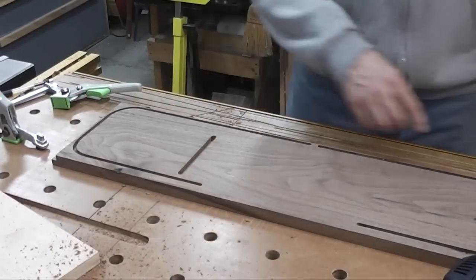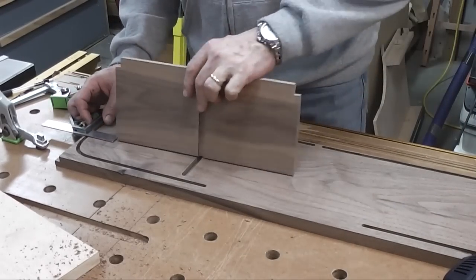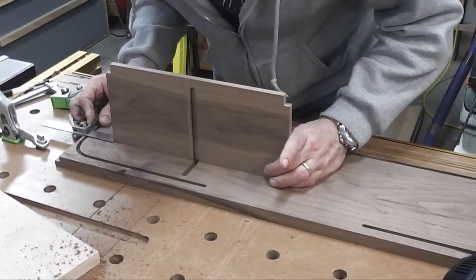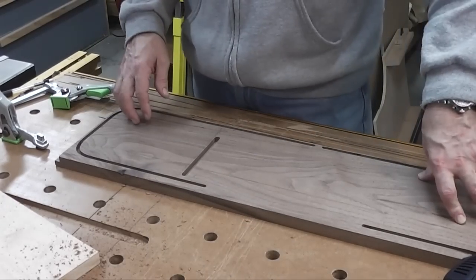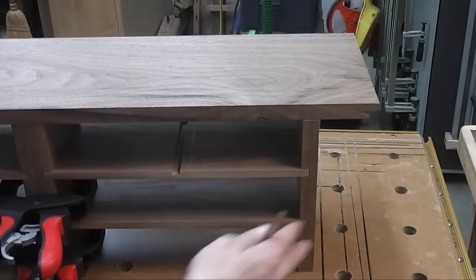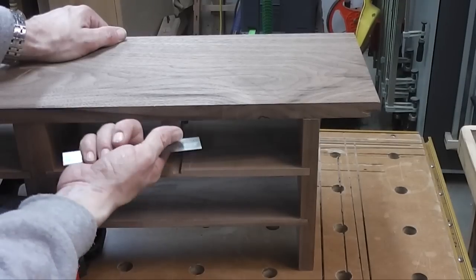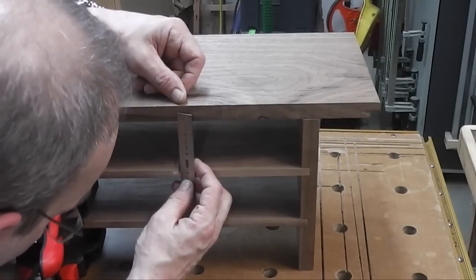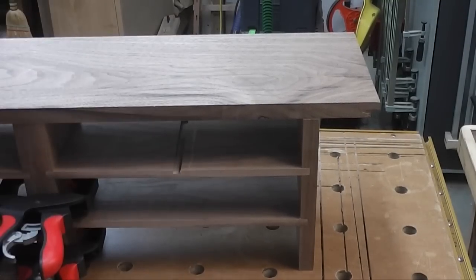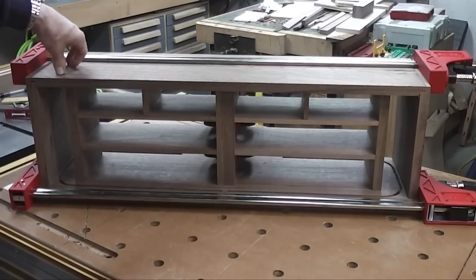Here's the first stop dado cut. If my math was correct — and I know it was because I checked this before I turned the camera on — 2⅛ inches over from the end is where the edge of this should be, and that should line up with my groove in the board. And it does, so I'm real happy with that. I just need to do the other side, and then I need to cut the pieces that go on the top. I've got these pieces semi-put together with a couple of clamps holding them. I want to get the measurement from the bottom of this dado up into the groove — I marked where the stop of that dado is and the depth, and going to the bottom of this I've got 3⅛ inches. Here's the dry fit of the case, and it came out pretty good. There are a couple of gaps here and there, but most of them will be covered up by some of the architectural details I'm going to put on the piece.